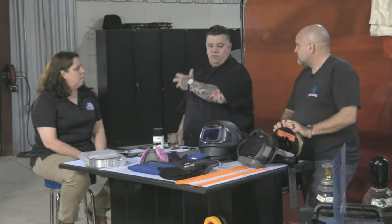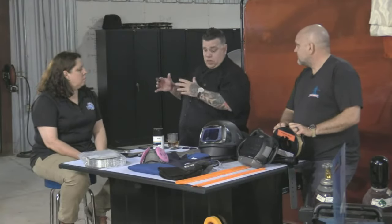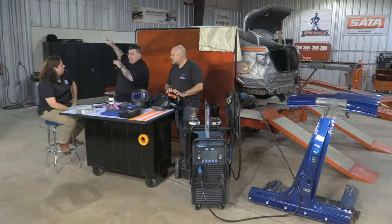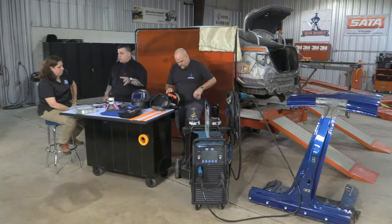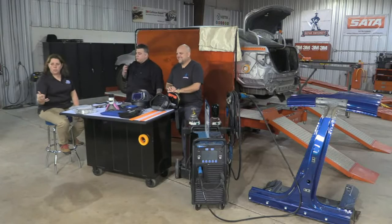We have 220 volts coming in, 5 to 6 amps. The resistance welder, which we don't have a picture of here, is trying to grab that 240 volts and 5 to 10 amps and turn it into 15,000 amps and only 5 to 10 volts. And it's shocking. If you don't have a thick enough wire, some of you guys might know this, you have the rattling in the rafters. You hear the wire shaking because you're using 6-gauge instead of 4-gauge, or you have too long of an extension cord, and that could cause a problem with a pacemaker. But once again, check with your doctor. It shouldn't affect you from what I understand. I'm not a doctor, though. It's not like radiation exposure from x-rays or whatever.